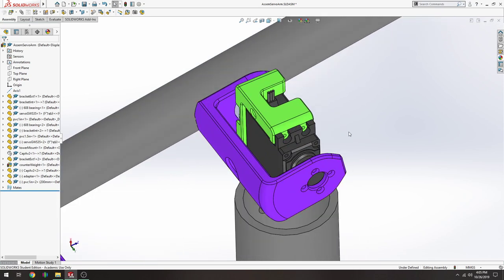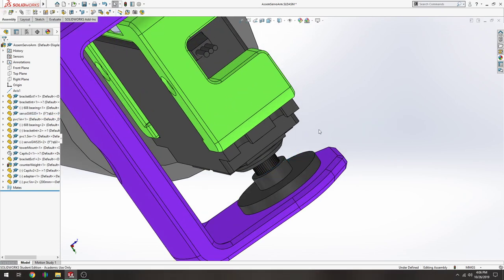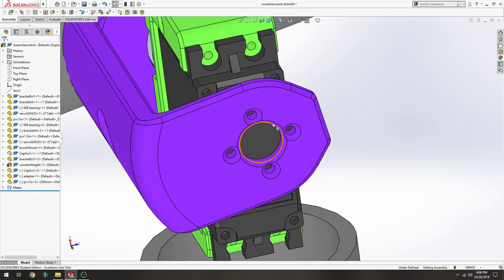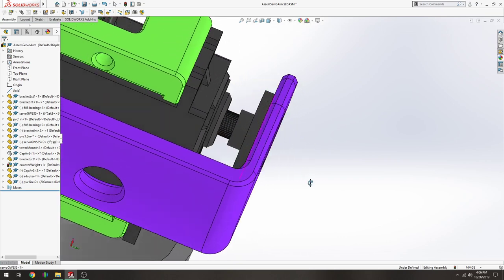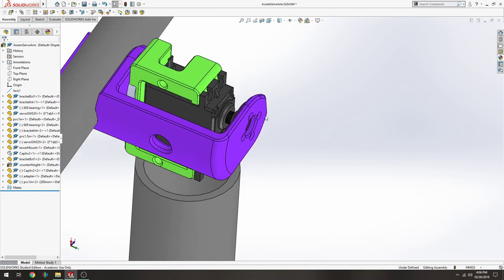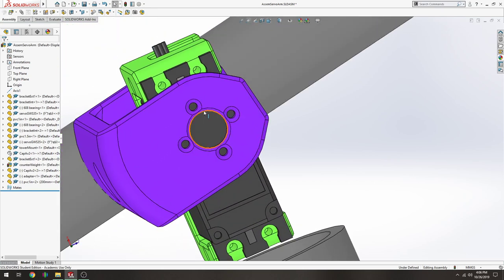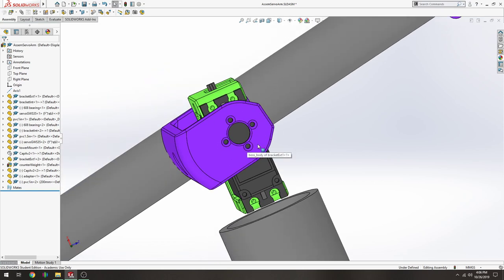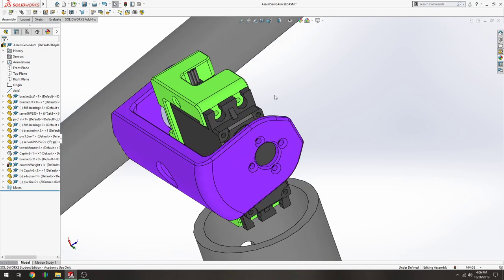Okay. And then this flat disc is a servo horn that comes with most common servos. You can see that in the purple 3D printed plastic part, I left clearance, and what's not modeled here and not shown here is the screw that secures the plastic servo horn onto this gear. Okay, and on my assembly this is metal, but on a lot of them they're nylon. Then in the servo horn also, I've not modeled, but I have measured the spacing for these four holes, and you can use an M2 coarse screw. That's the same one on a couple other locations on our robot.